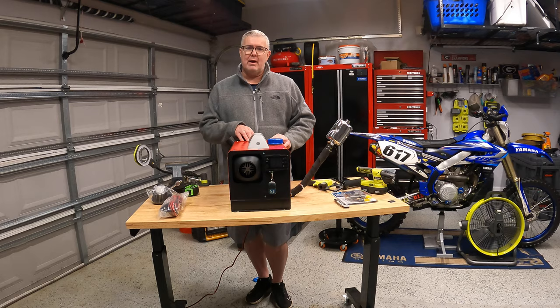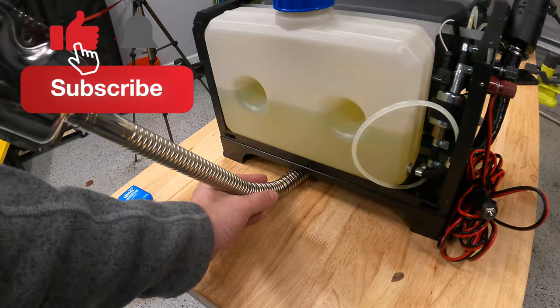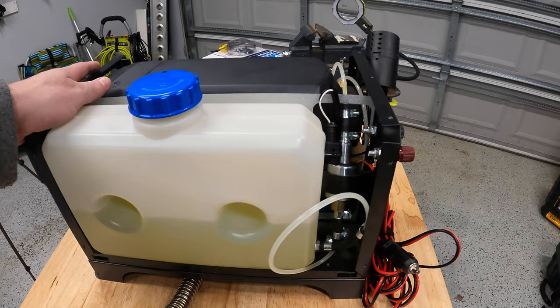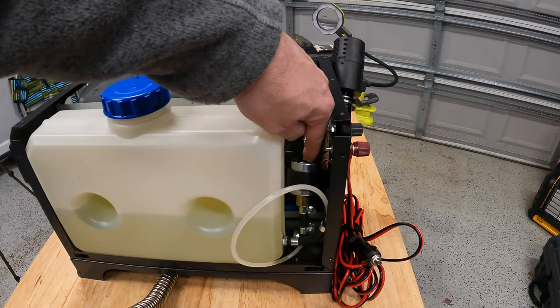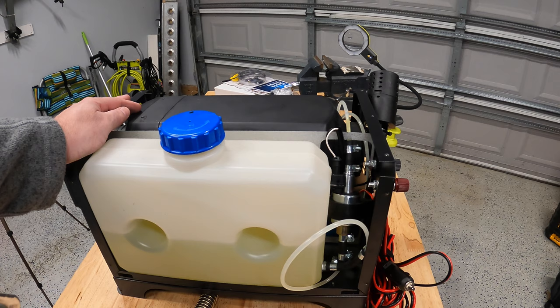All right. If we look at the diesel heater right here, I do have it taken apart. The shell comes off very easily. We've got the muffler here — this is one area we're going to put some tape on. This is the fuel reservoir, comes out very easily, and this is our culprit right in here. It's very small. We're going to pop this out and put a new one in, which is supposedly a lot quieter. It's still metal, and the reason these are loud is this piston inside — when it gets an electrical signal it pops and makes a clicking noise, and as you turn up the heat it increases just like pressing the gas pedal in a car. We're going to replace this with a new one bought on Amazon, which is supposed to be ultra quiet — about $50. This whole unit was only about $130, so we'll see if that's any quieter.